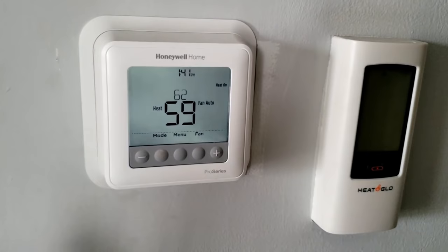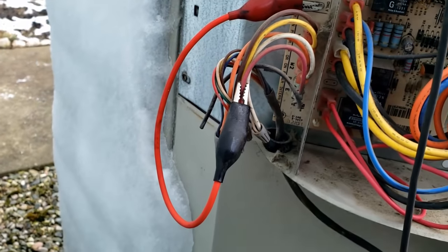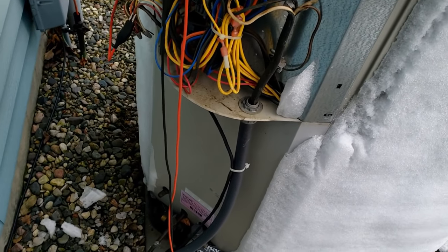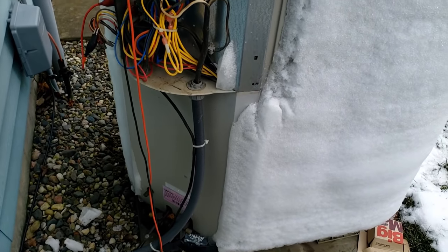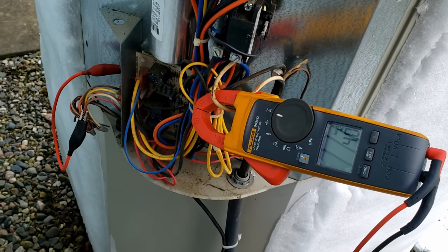Let's go ahead and reread this a couple more times because usually you just jump two wires together, nice and simple, and it goes into test — but they had to make things more complicated. Flipped it back on and the fan immediately came on, so maybe I did something out of order. We've got it back on regular heat. Figured it out — you've got to take test to common. Putting it into defrost now: fans shut off, which is a good sign. Running emergency heat mode, auxiliary strips are on, and we're starting to see some melting. The compressor is only pulling 4 amps, which is kind of low in my opinion.